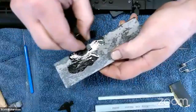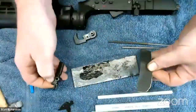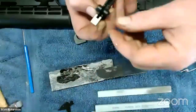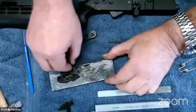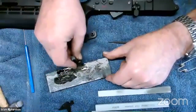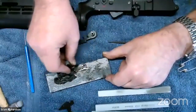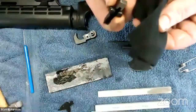There was a question: can we do this on 3000-grit wet-dry sandpaper on glass? Yeah, if you have a super flat surface, you could do the same thing with wet-and-dry paper. I do recommend having an Arkansas stone though — it's very handy for sharpening knives and polishing. Not just triggers, but anything that needs a fine metal polish. The important thing is keeping that surface sitting flush, and not applying much pressure — you're just letting the weight of your hand do it.